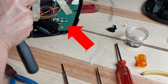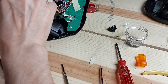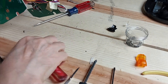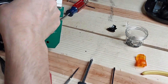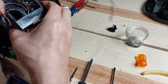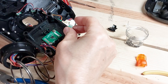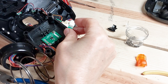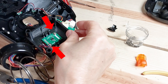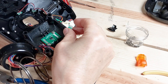This green board is the main circuit board in the joystick and we'll be using it in the collective. Underneath the handle of the joystick, in the center of the base, is a small plastic platform that holds the spring and contains the small green board that is the Hall effect sensor. The Hall effect sensor and the main circuit board are the two main things we'll be using from the joystick. Unscrew the Hall effect sensor from its little platform and carefully thread it through the spring with its wire so that it can be removed intact with the circuit board.